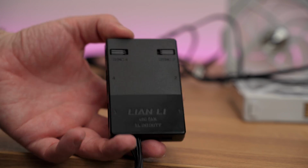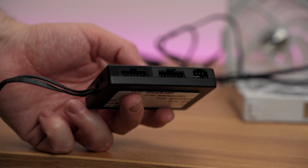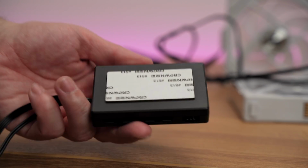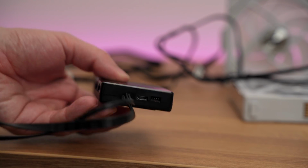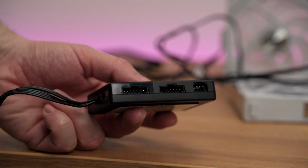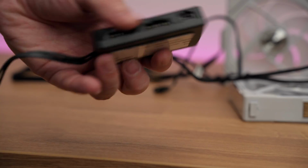Connecting the fans to the controller is easier than before. The power cable is now one single connection, so cable mess is no more. The single cable includes ARGB and PWM in this single connector, and up to 4 fans can be used per one channel on the controller for the total of 16 fans per controller. But the controller also features two 3-pin ARGB SM-type ports to directly connect to other Lian Li ARGB accessories, for example the Galahad AIO pump LEDs.